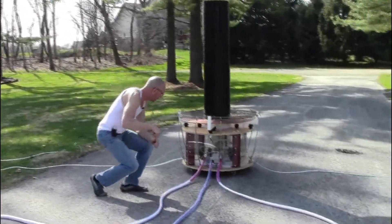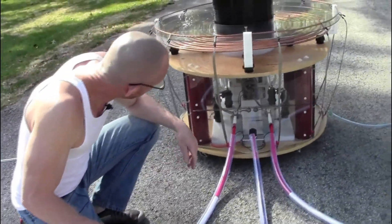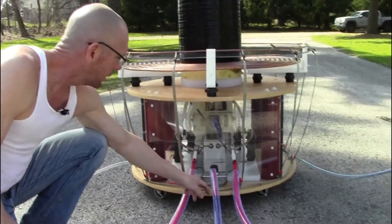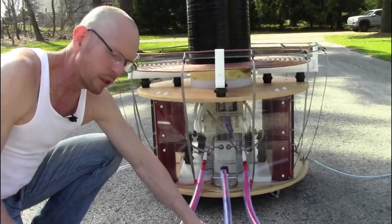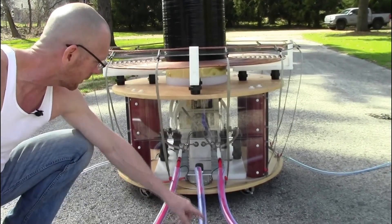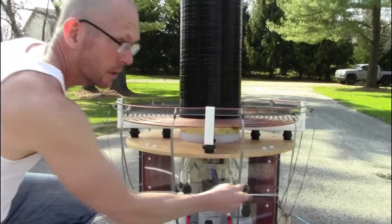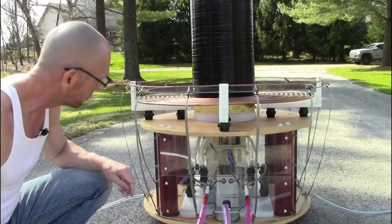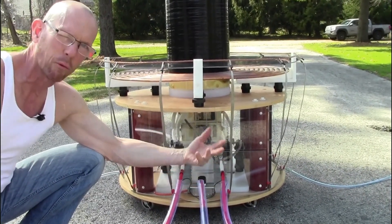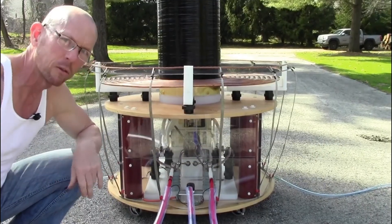Moving into the tank circuit of the Tesla coil — the control cable used to modulate the phasing of the rotor on the motor is right here, plugged into this receptacle. This cable is shielded and bonded with a braided ground not interconnected to the powertrain. That ground is bonded into a braided strap which exits to either side into a grounding grid. I call the high-voltage cables 'primary' because I'm a lineman — technically they'd be secondary, but that makes no sense to me.